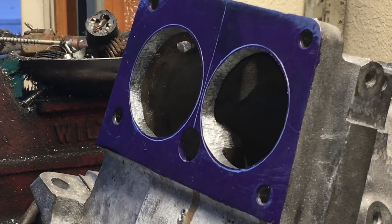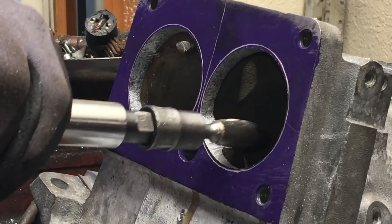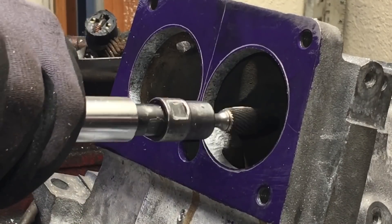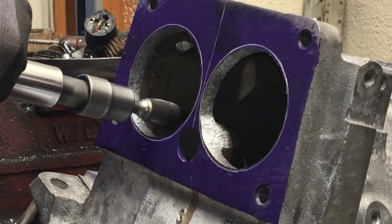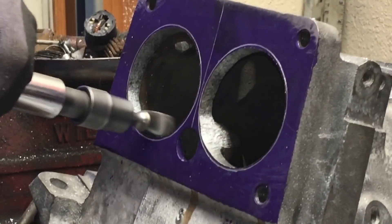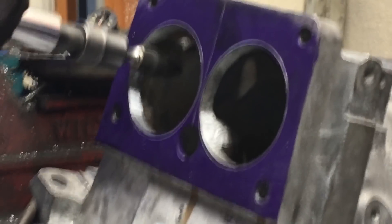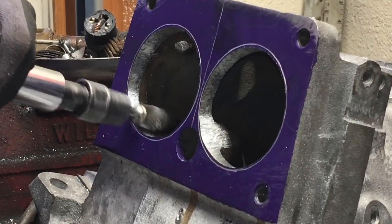One of the main reasons I use those larger diameter cutting burrs is this: when you're working with too small a diameter burr, it's easy to get divots — the bit will dig in and leave rough spots on the surface. But if you use slightly larger diameter bits, you can control the movement of your tool, keep everything smooth, and not let it dig in on you. You can actually smooth out a lot of those rough spots left by the rougher cut burr.